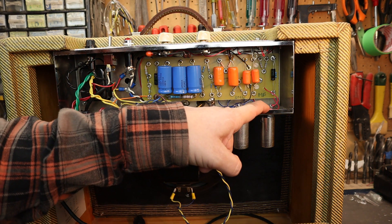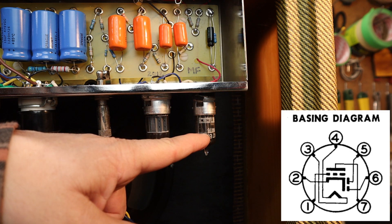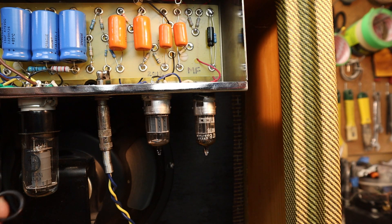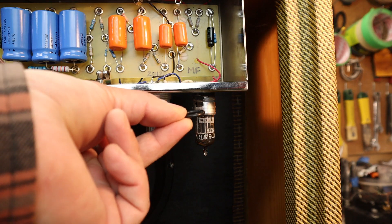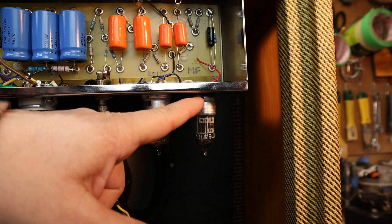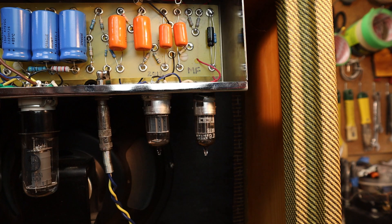What's really crucial in this amp is the 6AT6 tube. The 6AT6 is kind of a funky tube — it's a little smaller than the 12AX7, and it only has one triode section. I had to buy a bunch of them to find one that was not microphonic, so when you buy them, order a bunch right away. I also sandwiched a washer in there — you can find these in the plumbing section of your local hardware store — sandwiched between the chassis and the tube socket. The nut and washer holding the tube socket also have rubber grommets to help isolate it, so if the speaker vibrates the chassis, it doesn't vibrate the tube too much.